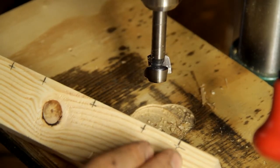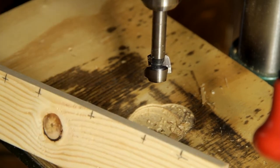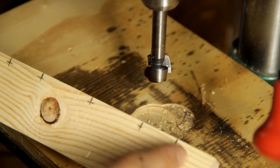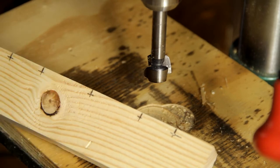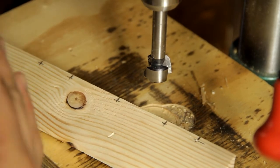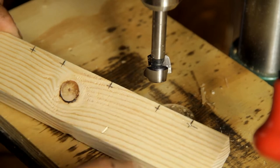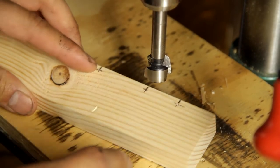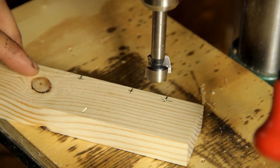I went ahead and made some marks for what I'll call half-moons that we're going to drill out. This is for the bar to rest inside so you can adjust your tabletop to different angles. I measured one inch from the end, then two inches, then every inch and a half, and then one inch from the last mark — this gives me the most adjustability for the tabletop angle. I marked about an eighth inch from the edge to give the Forstner bit some room to bite on, because placing the center right at the edge is more likely to push the piece away and won't come out as clean. Then I'll clamp these down and drill them out.